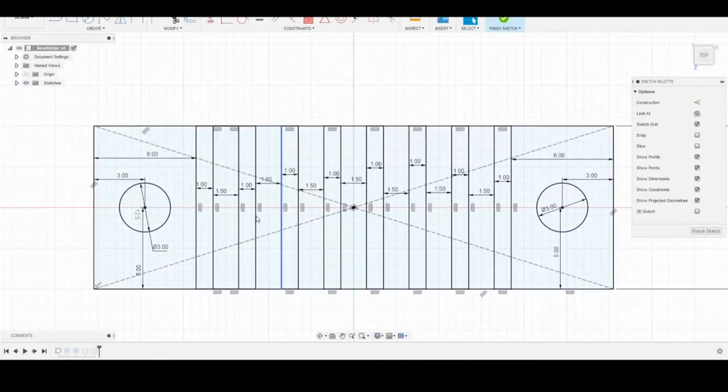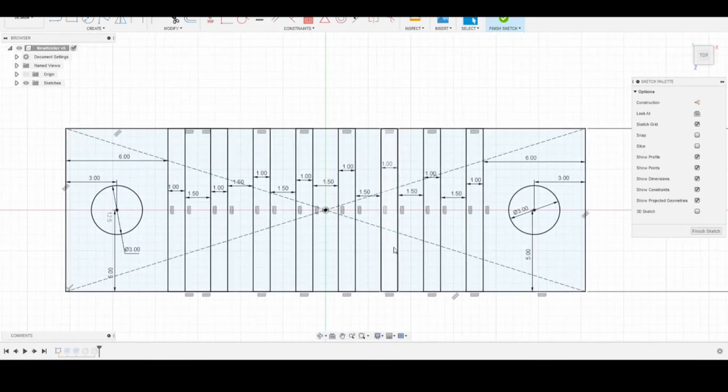You can see I just made a square and gave it a lot of little boxes. It's 1 millimeter within these specs, the little holes where the wires can go through, and I'm always leaving 1.5 millimeters between each so that they're spaced out. And these say 3 millimeters, though they're supposed to be like 2.8, I think, is what the screws actually are. But they need to be 3 millimeters simply because, again, if you're working with a 0.4 millimeter nozzle, the wall width will make sure that this is all smaller anyway. They're just a very tight fit, even with those added 0.2 millimeters.